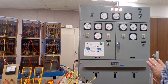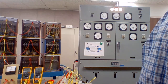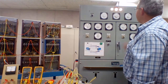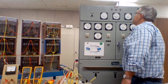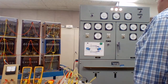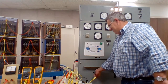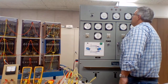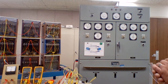As we're falling out of sync, we're going to let this rotate. We've got our incoming generator running slightly faster than the running one, and when they get to 12 — when they're closing at 12 — we're going to turn both generators on so these two generators are locked in harmony.